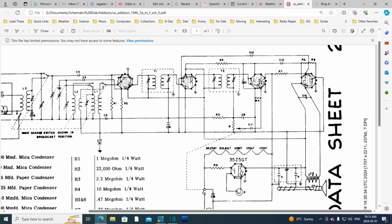These tubes are not, how can I say, you will get harmonics, or potentially have harmonics developed in these tubes because of nonlinear operation. Those harmonics are either a waste, you're not going to hear them because they're too high a frequency, you're just wasting power a little bit, or in fact you are going to hear them, and they're going to color the sound a little bit. So in goes a capacitor here to snag the highest frequencies and do away with them, so they don't charge up the transformer here.